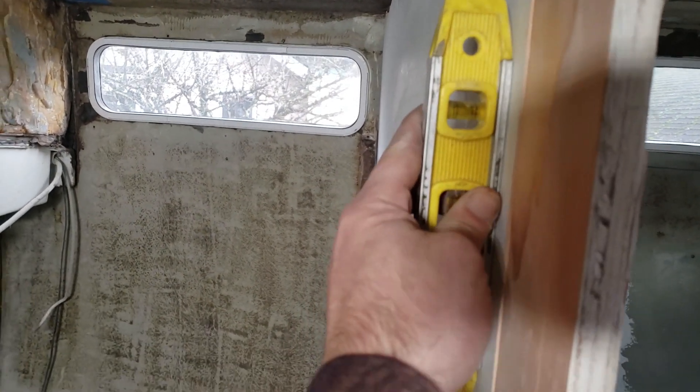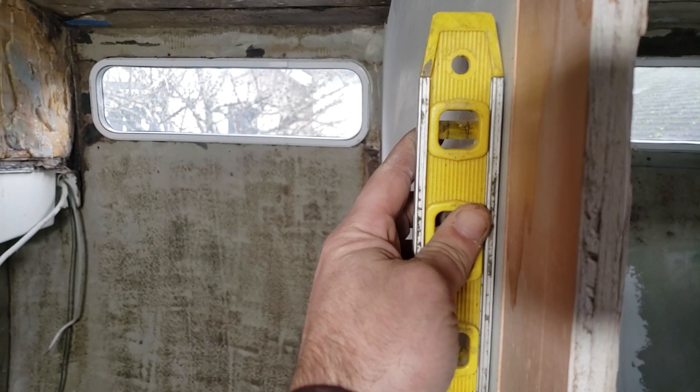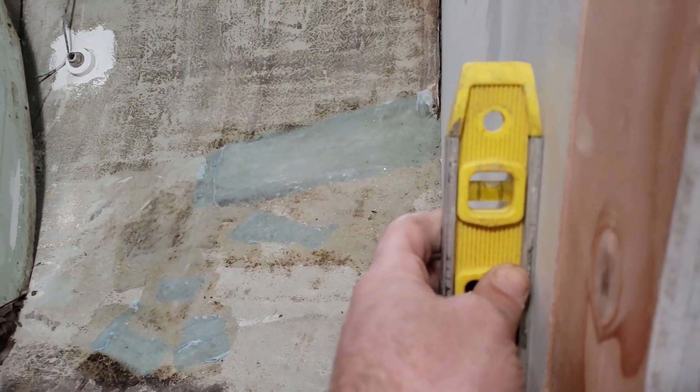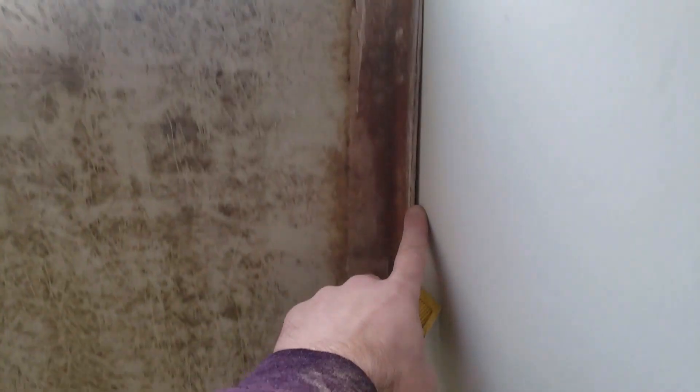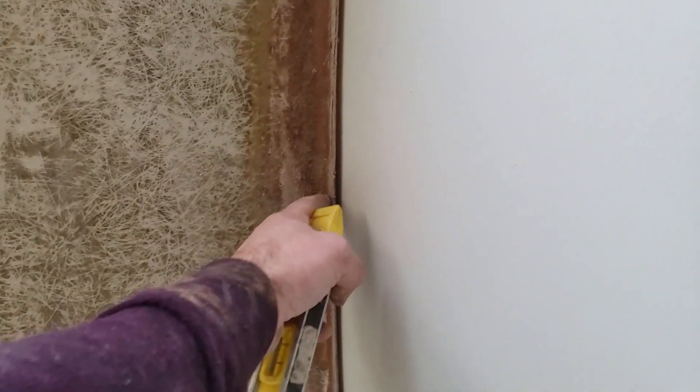It's the way Kelly wants it — she wants a nice cozy little space. You can see how on this end the bubble rides the right side, and down here it's less so. The boat as a whole kind of rides that back side of the bubble. Down here it seems nice and straight, there's like a bow in it, and as we get higher up it gets worse. This is what the old one was tabbed into, so I'm going to push this over, put a screw in here, make sure we've got it exactly where we want it, and then we'll glass it in place on the other side. Once that hardens, we'll cut this off and glass it in over here, and it will look real nice.